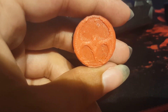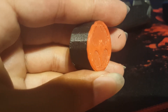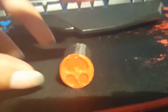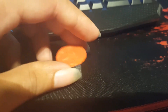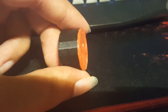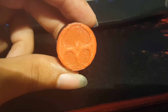This is all still ABS plastic. I've really gone up and beyond when it comes to printing with ABS plastic. Now I'm trying to mix different colors and filaments — I have red, black, and white. This knob is 27 or 28 millimeters around and 15 millimeters from top to bottom, and it has a 1 millimeter offset for the bat symbol. I probably should have made it 2 millimeters to give it finer detail, but you can still see it — it's still okay.